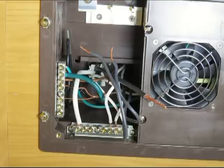It will become a bird's nest in there, and one of the things I noticed is I buried the converter black wire way behind everything, and I had to dig it back out. So keep the converter black wire out in front, because it's got to hook up to a breaker so that it gets power, so that you're powering your battery charger and house power.